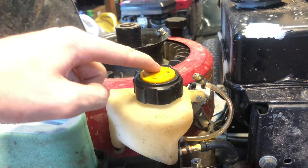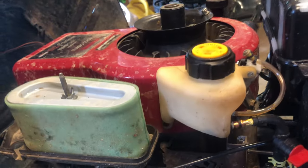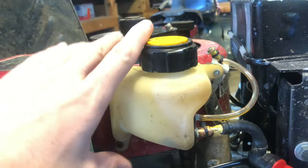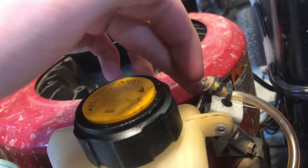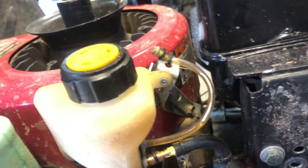So how did I mount it? I kind of played around both sides and it seemed more logical to put it on this side. This hole was already in the motor, so I just ran a wood screw right in there — that held the front end — and the second one right there is the bolt that holds the fan shroud on. I ran some plumber tape up to this top part of the mounting tab and ran a piece of steel to that to give it some support, and as you can see it is pretty solid.